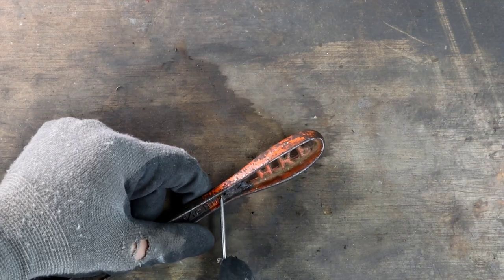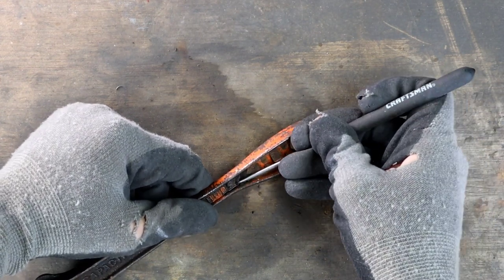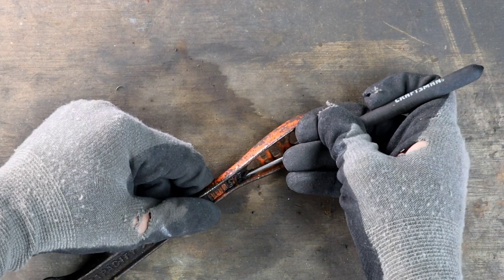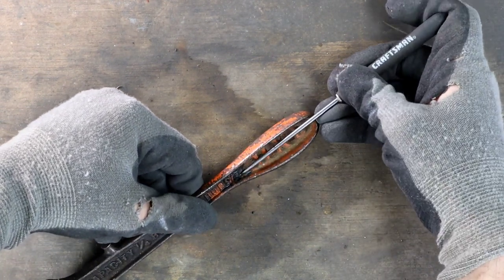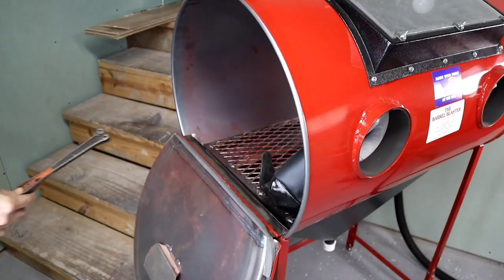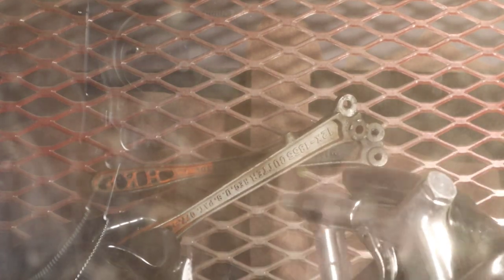The two handles had a tar-like material stuck on them, so I spent some extra time with a small pick, being careful not to put any scratches into the metal. I'm taking these to the sandblasting booth, and while the sandblaster would remove the material, I don't want to contaminate my abrasive or potentially jam up the feeding tube or gun later on. In the cabinet, I'm using an 80-grit abrasive to remove the old paint and rust. I intentionally used the small 6-gallon American-made DeWalt compressor. My goal here is to show that sandblasting is still a viable option for those that only have a small compressor.